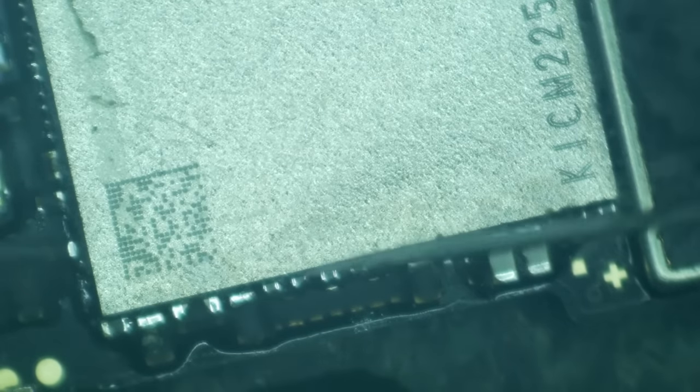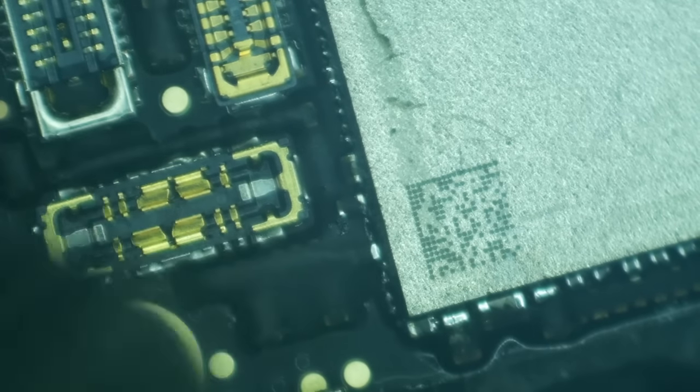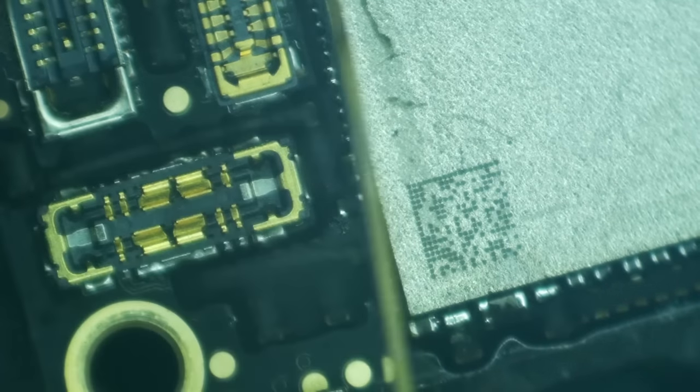And again, if this was the donor board prep here, I spend a lot of time cleaning out around these components just to make sure that everything sits and can float nicely. It's also why I have largely started keeping my donor boards. Once the recovery is complete, I take the customer's chips off and I keep my donor board because I trust it. And I have a 13 Pro board here that's now getting ready to go on its third recovery. It's awesome.